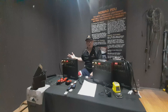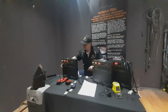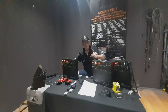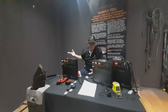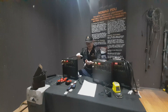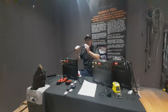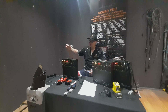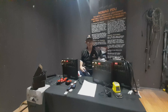If you have a solar panel without a regulator — I personally use a 200-watt solar panel without one — you connect directly to the red and black poles. I've made an adapter for this. From the solar panel with no regulator I connect it here and it goes into the MPPT controller inside the unit. This is a maximum of 10 amps — the most you can put in there is 10 amps. My 200-watt panel will not put more than 10 amps in. You can use the power analyzer between the solar panel and the Nomad to see exactly how much the panel is putting in — that's why these are great to have. The internal MPPT will regulate the charge specifically for lithium.